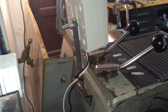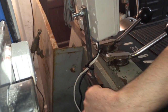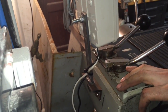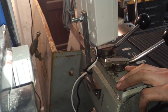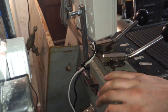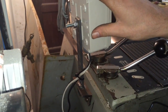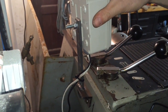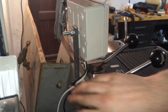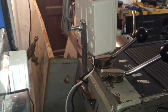On the back of the headstock I just have a small bit of angle iron bolted into two holes that were already there — I think they're a quarter UNC. A small bit of flat steel welded on — two pieces welded on because it's easier — and then the box just bolted on with one bolt. That's all. A fairly simple bracket. I'll probably end up changing it if I ever put a DRO on the lathe.